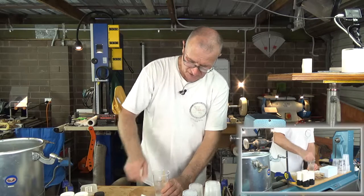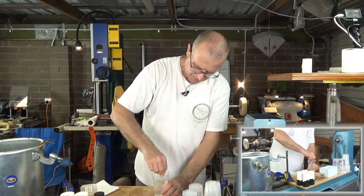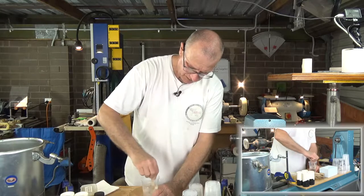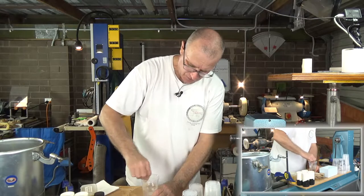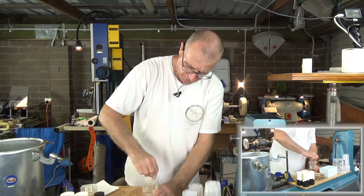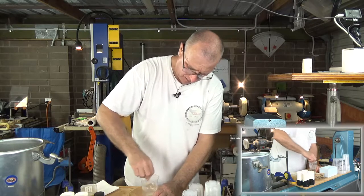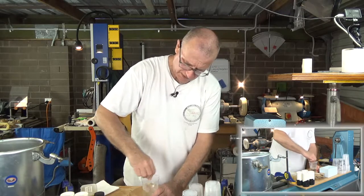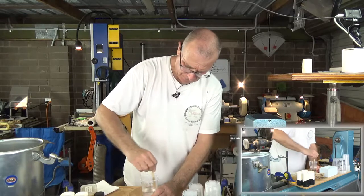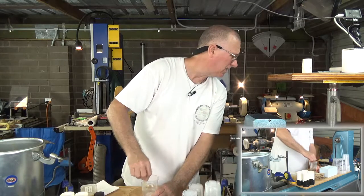and I don't know how the resin's going to go tonight either, from the fact that, I mean, I can see it's a lot thinner because of the heat. But I don't know how it's going to react tonight with the heat as well. I'd imagine that the turning point for the resin will be much quicker tonight. So it'll be quick work with the mixing of the colours and stuff, and then straight in the pressure pot before it has time to start gelling and curing.